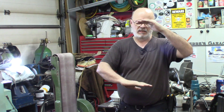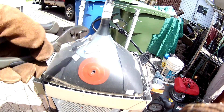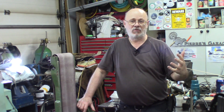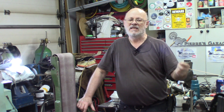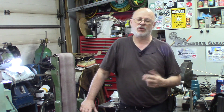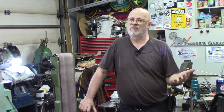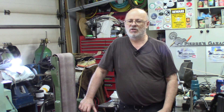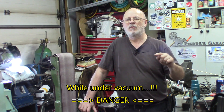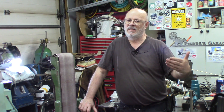The front of this vacuum tube is thick, heavy glass, and going toward the back it narrows into a funnel shape where the little electron cannon sits. The glass at the back is much thinner and more prone to breakage. Since there's a very high vacuum inside, if you break it, it will implode and throw very sharp shrapnel — pieces of glass — all over the place. It's deadly in many circumstances. So you never throw an unprotected tube in the garbage or leave it accessible to people, because it's like a potential bomb.